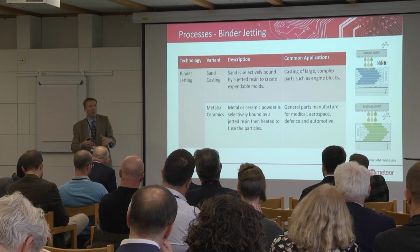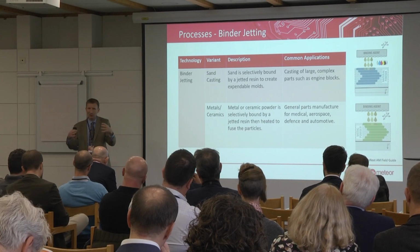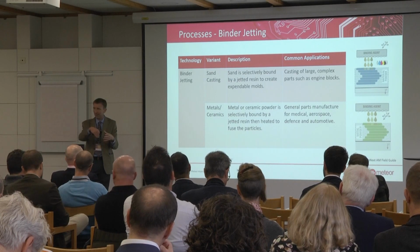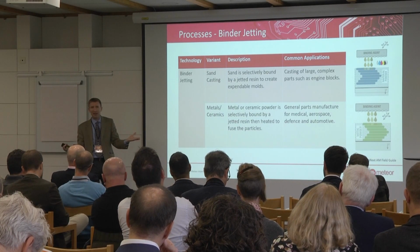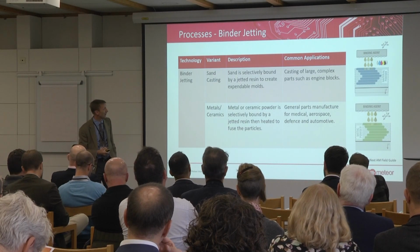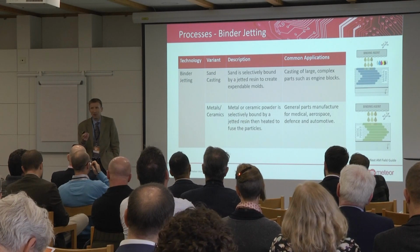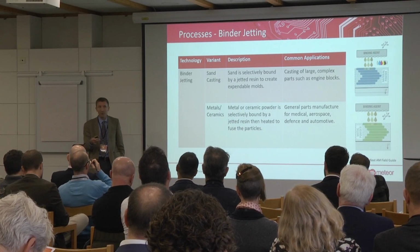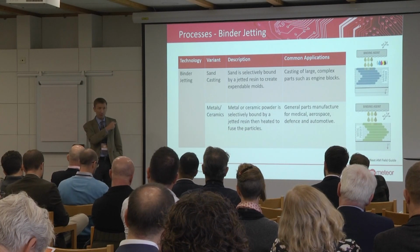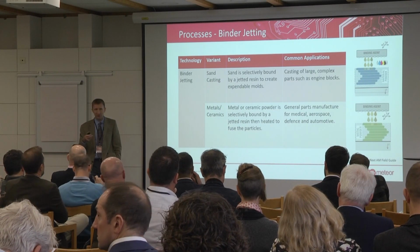It's sand. But the exciting thing is if that shape happens to be the inverse of what you want, you can use it as a mould. So you're casting your true material into that shape, and then you throw away the sand anyway. You break it all up. So sand casting is actually a very exciting, financially exciting area because you can make these fantastic cast shapes very quickly and very easily, digitally, straight from a 3D CAD through one of these machines. Instead of having to make mould tools, you can machine them and so on.